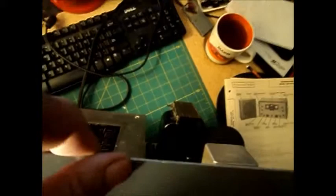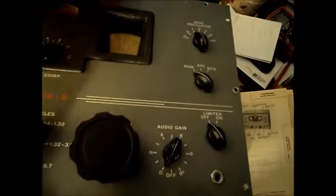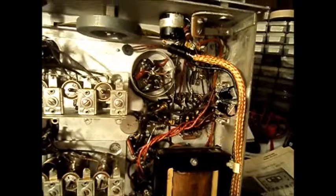Additionally, you don't have the hot tube sitting right next to the transformer. So the whole radio runs cooler. And the benefit of that is you get less drift on the radio if it's running cooler. It's a good benefit all the way around. That's what I'm going to go with for the rectifier. My rectifier tube is quite weak anyway.